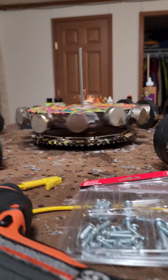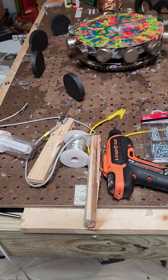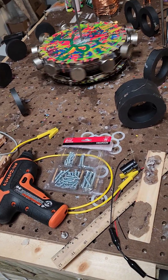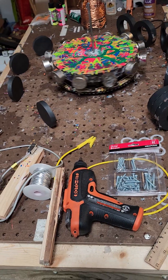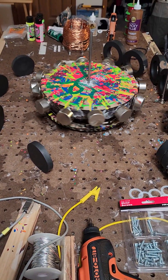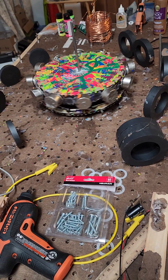It's working pretty well. The top disc is the one we're measuring, but the bottom disc is moving with it because of the way the magnets are set up. The bottom disc has a bearing that's 80% more efficient than the bearings in the top disc. So the friction of resting on something and spinning at the same time is reduced. I spin it with my finger and it's moving more freely than it ever has since I built it yesterday.